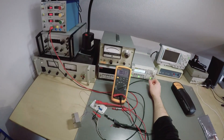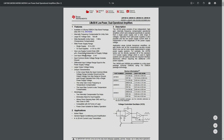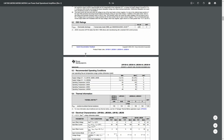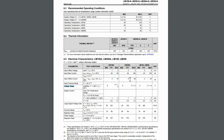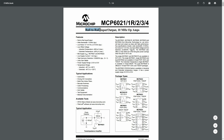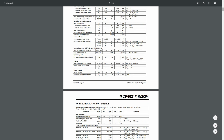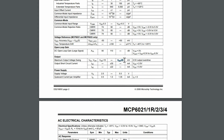Another problem though: I found that the maximum current output from this constant current source is mainly limited by three factors. I chose to use the existing 5V power supply. There's a substantial voltage drop across power LEDs and power laser diodes. And the maximum output voltage of the general-purpose op-amp I was using is the positive supply voltage minus 1.5V. At least one of those can easily be changed — so-called rail-to-rail op-amps can bring their output very close to the supply rail voltage. I even happen to have one of these in stock, though there's a little problem involved.